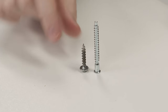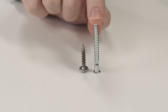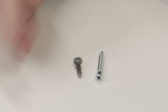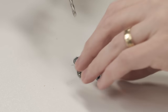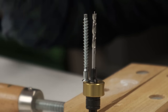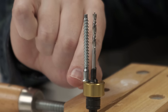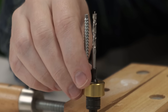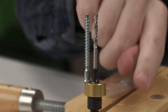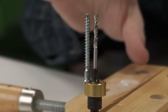Another thing to point out between these two screws is that the pocket hole screw has a point on it - it's self-drilling. Whereas the Confirmat screw is nice and blunt on the end. It means you can brute force the pocket hole screw through - you just need a small pilot hole and it'll do the rest. Confirmat screws, not so much. You need to have the matching profiles. The drill bit matches the size of the screw - it has a nice straight cutter for the shank, then when we get to the head end there is another cutter for the widened head, and then the very tip has a Phillips head. This will sit just slightly underneath the surface of the melamine so there's enough room to put a cap on it if we want to.